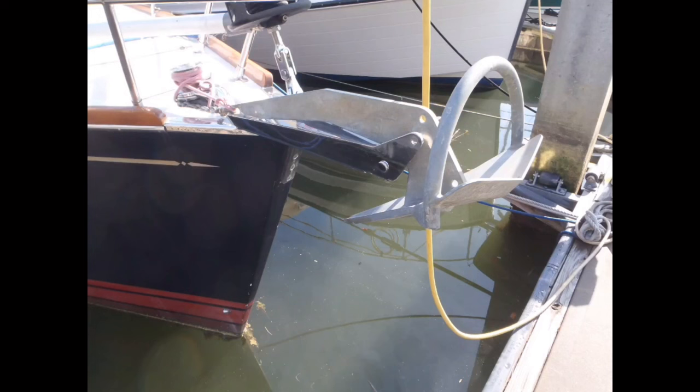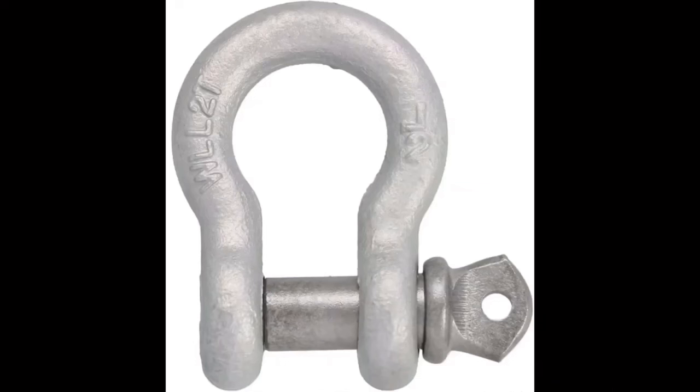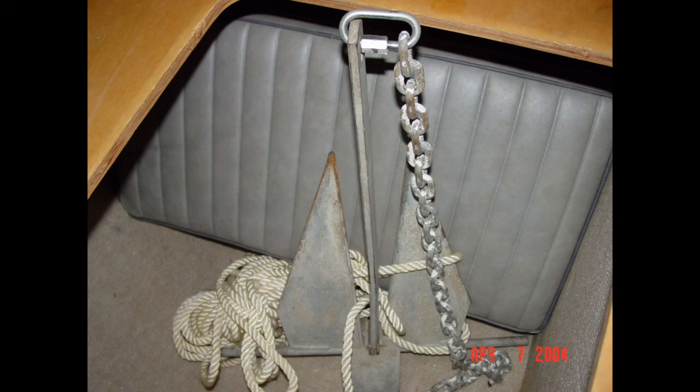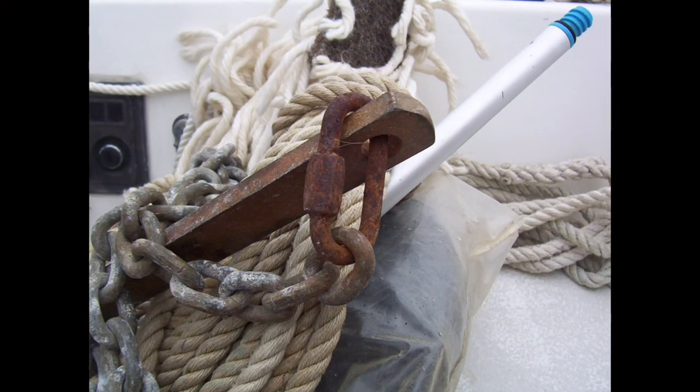If your anchor rode utilizes a shackle to connect chain to anchor, an anchor shackle should always be used. Anchor shackles are C-shaped to reduce binding and provide greater freedom of movement, as opposed to chain shackles, which are more U-shaped. What should not be used is a quick connect link. Quick connect links are designed to join chain, though even then they should be considered a temporary measure at best. They're weaker than a connecting link, which is the proper way to connect shots of chain, and they can bind or jump off when passing through a windlass or wildcat due to their larger size. They're also weaker than a properly sized anchor shackle, offer less freedom of movement, and are prone to seizing due to corrosion and/or thread distortion.